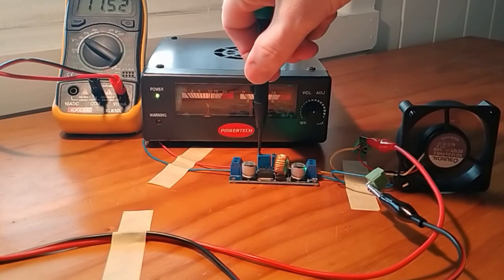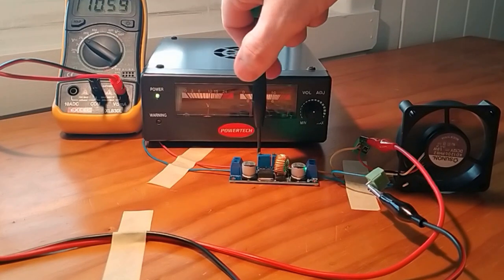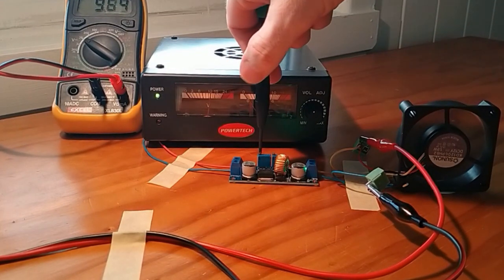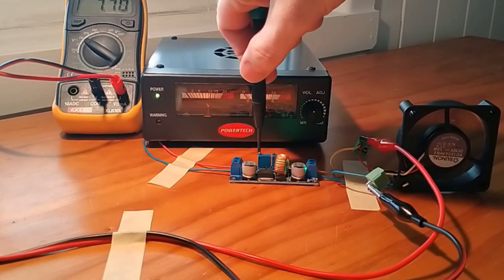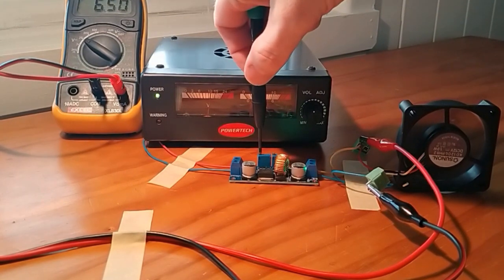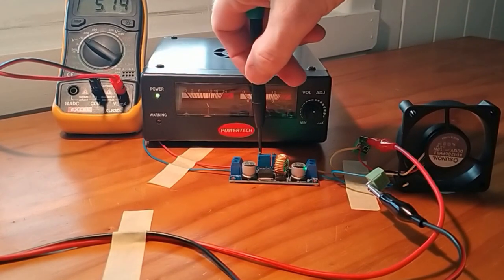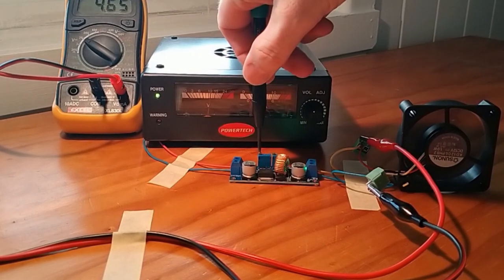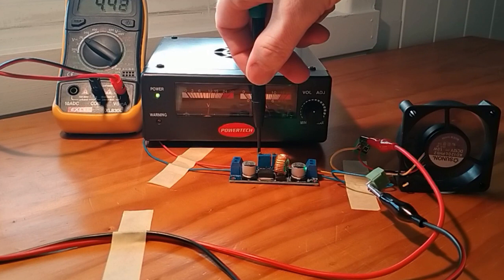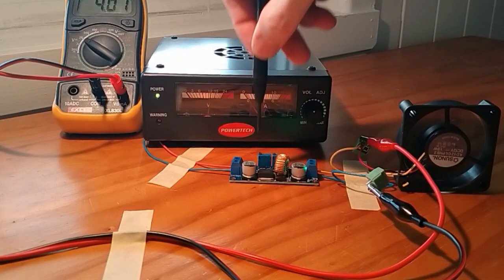Now you'll start to hear the fan, see the fan here, hear the fan, the RPM is changing here. So I'm just going to keep going until I take it all the way down to 4 volts. Keep going. It doesn't have to be spot on, but we'll just take it to about 4 volts, so that we can throttle that taser module. I'm pretty happy with that.